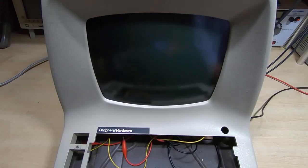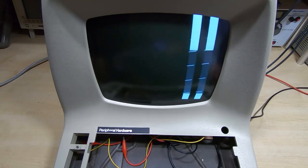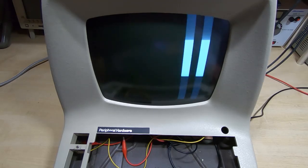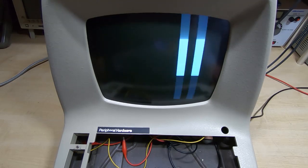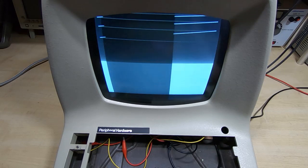Let's see if it still works. Turn on the power, turn on the signal generators, and wait for the tube to warm up. Looking very promising. You've probably seen flicker on the camera, but there's no flicker evident on the screen. We can see the flyback traces — the very thin short horizontal lines — that's just because there's no flyback blanking with this setup. But as you can see, all signs of the cataracts have gone. I'll try a few different signals so we can get a better look at the tube full screen right across the area.